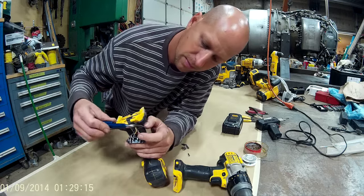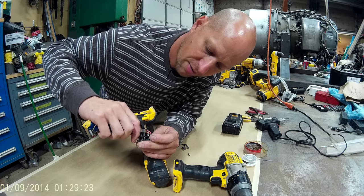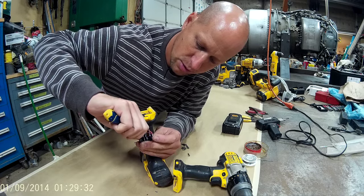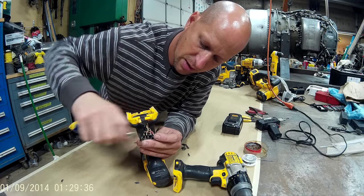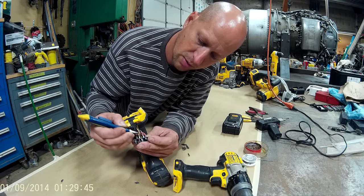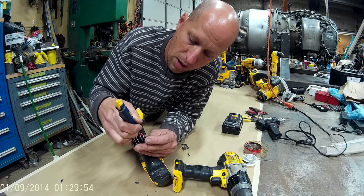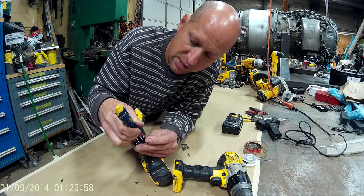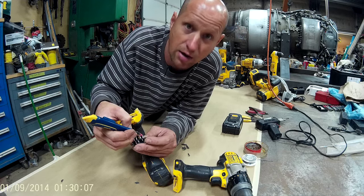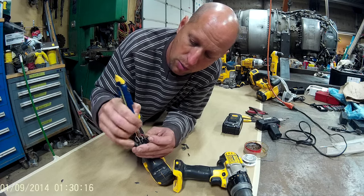Let's cut off this heat shrink and we'll see if that is the case. What I have found is that when they attach these wires, they strip the wire, wrap it around the terminal post, and flux and solder it. What will happen is the wire breaks right here, or right there, or right up in here. Because when they put the flux on the wire and then put the solder on it, the solder sucks up the wire wherever the flux is. So what you end up with is a normally flexible wire which, when it comes up to this point right here, is now rock hard because the solder has wicked up the wire. And then as the tool bounces and vibrates, that wire will break right there.